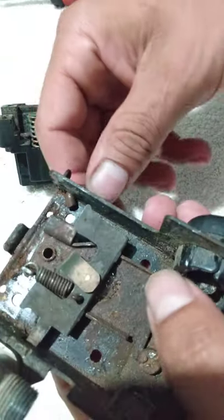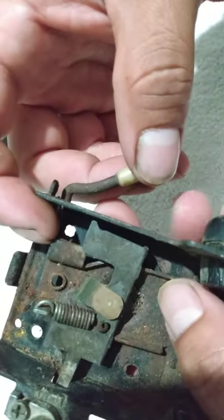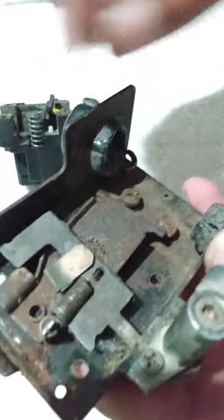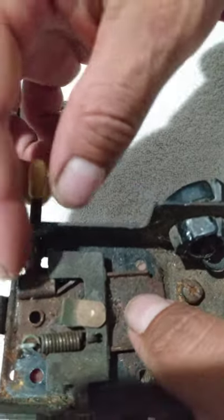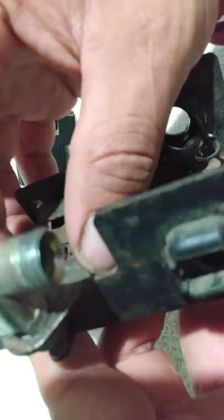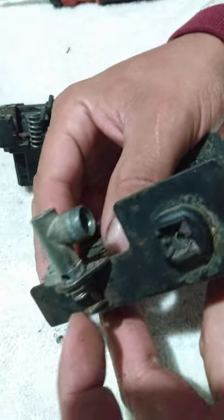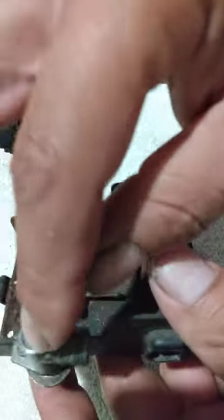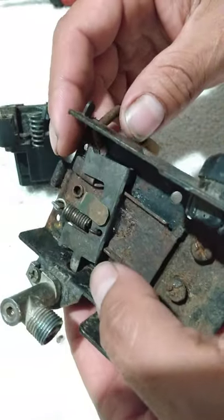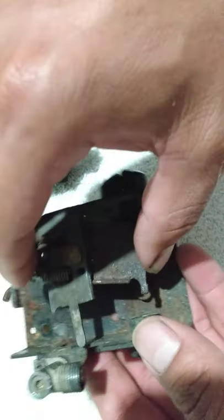That looks confusing. This little lever goes right there on this part, the bottom part of that control switch. So whenever you engage it, when you turn it off, it picks up on this thing here, and it picks up right here where this unloader valve is, and it pushes up that pin right there. Pushes up that pin in that unloader valve, and that's what kills the power and everything, and it pushes that up so it won't bleed all the air out. But here, let me take it all apart and then I'll get back to you.